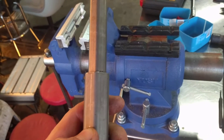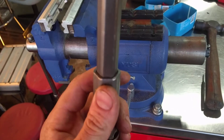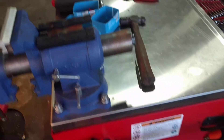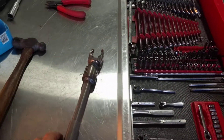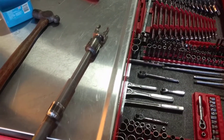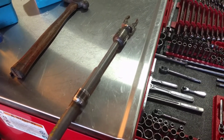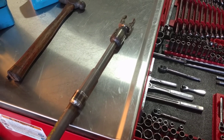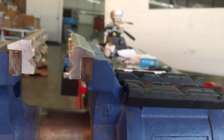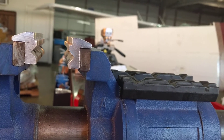If you want to try this method, it may save you some welding. I don't know if it would be any safer than welding, because it depends on how tight it actually crimps down on it. But welders aren't available to everybody in their garage. So if you want to try something else and you have a pretty heavy duty vise and a pair of aluminum jaws, or you could fabricate something to stick in the vise — they just need to be somewhat profiled so you have a nice pair of corners to push down on.